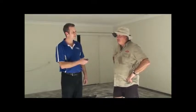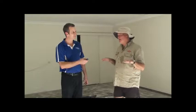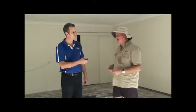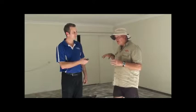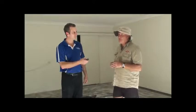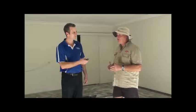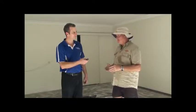It's really to do with volume of epoxy. I have used, in the past, prime coats where we'll actually prime it, and if it's so porous that we need to prime it and come back the next day, then that will be the approach we take. But I very seldom do that now because of this epoxy. We just tend to put on a thicker coat of epoxy, and a proportion of that will bleed into the porous slab.